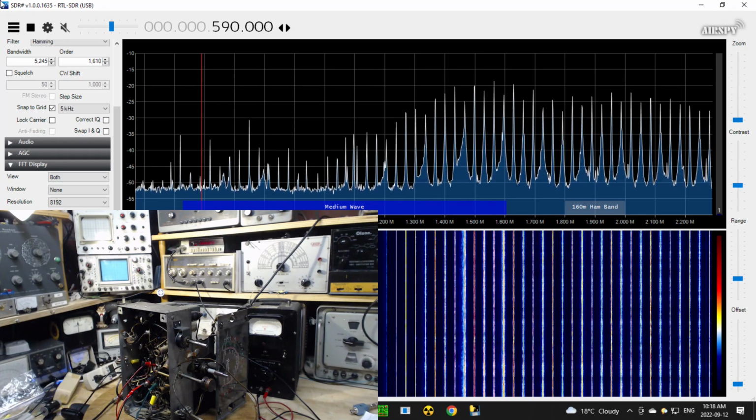But in a good radio, with this kind of test, you'll actually see a bump. Let me use my mouse here. You'll see a bump. It looks something like this bump, or maybe like this one, maybe a little broader. And as you tune the radio, the bump will travel up. Everywhere the bump goes, the signals are boosted relative to the noise, which is the whole idea of the front end: get the signal stronger relative to the noise. This has worked really well with a number of radios I've done. It's not going to work well with this one.